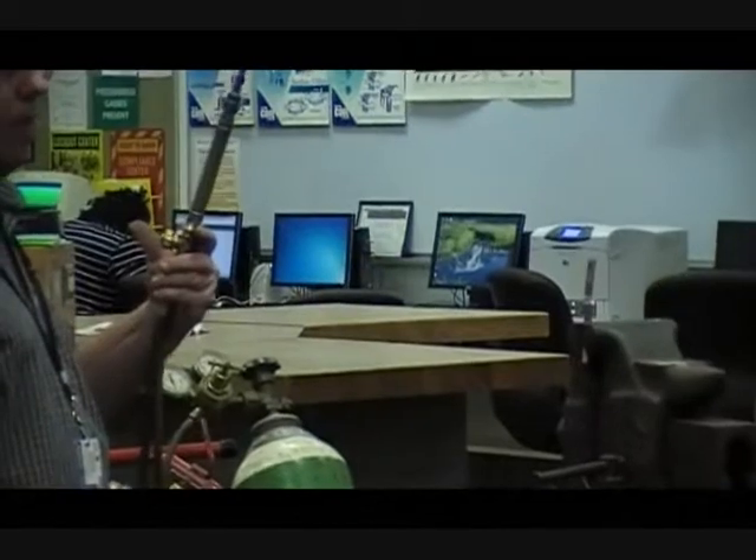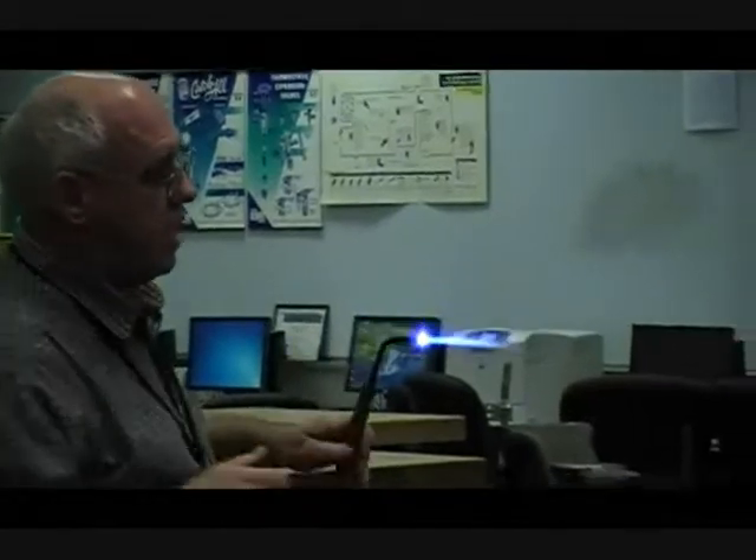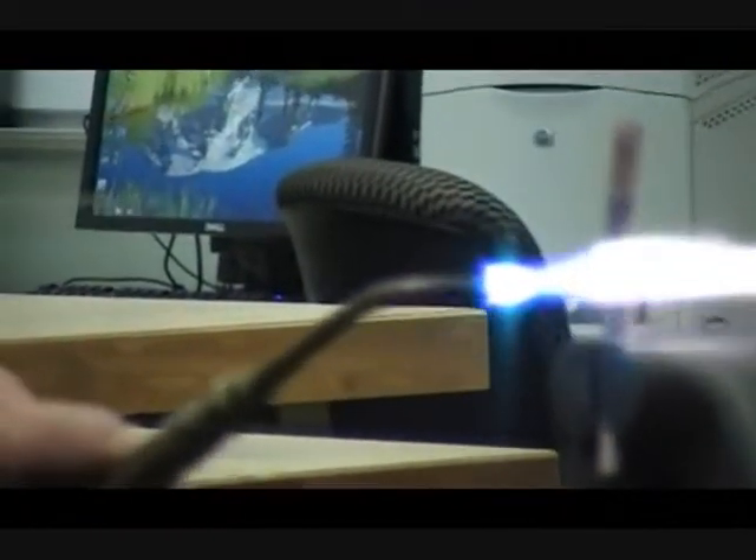I've got a neutral flame — y'all see that? Now this flame is much hotter at one point. The hottest part of this flame is right there where the two cones come together. It does wrap around, but on larger pipes sometimes you have to keep the concentration at the point where you're at. If you can get that evenly heated all the way around, that's the trick. You're going to have to put this filler material where you want it. It does have some capillary action and some flow, but not like the regular solder.